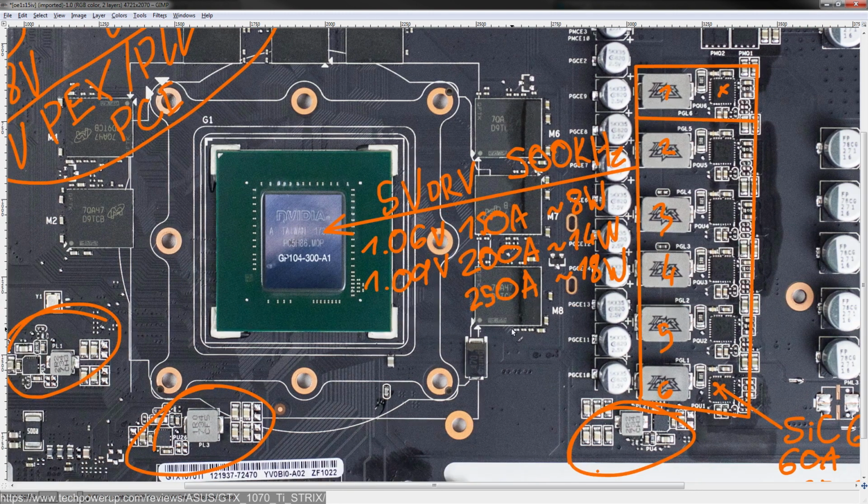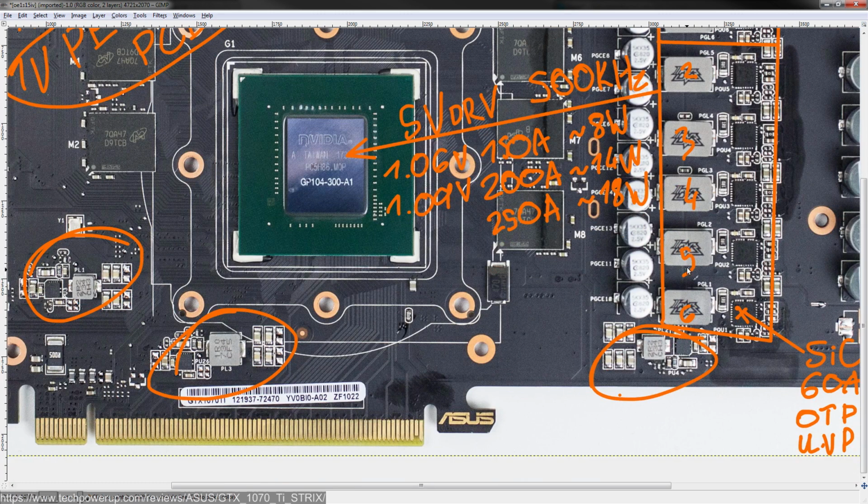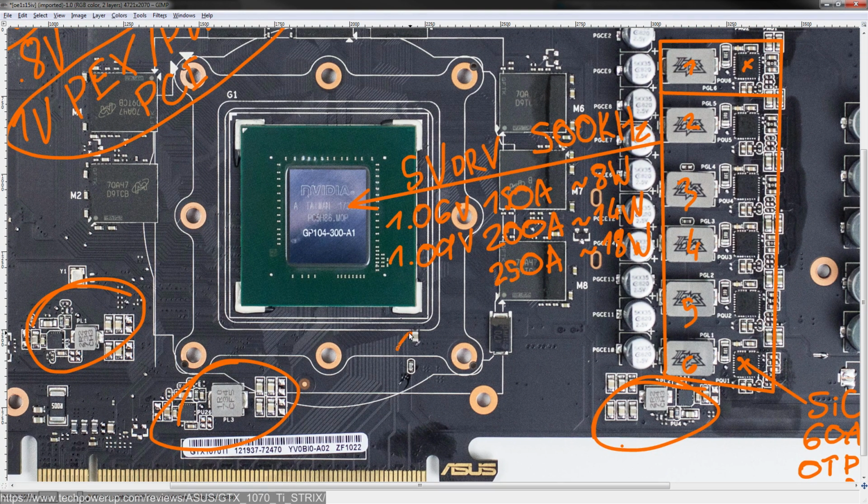Anyway, if you do decide to go competitive overclocking on this card, you'll probably max out around 1.35 volts, just because the GP104 chip really doesn't like super high voltages. It just straight up stops. It really doesn't work well at very high voltages. In excess of 1.4 volts starts being problematic on most cards. And in my experience, my 1070 maxed out around 1.35 as well, or 1.38. It never really got up to 1.4. So you're going to hover around lower voltages. I've also heard that other cards can't even go over 1.3, so it depends on the card you get.